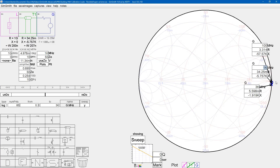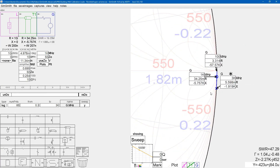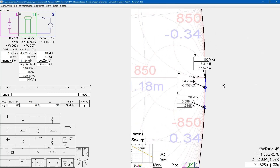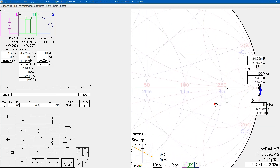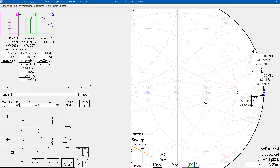Here's an example in SimSmith as to what's going on, which might help. I've got an open, as referenced by a one-gigaohm resistor, and a small piece of transmission line which matches my measurements — 11.34 milli-inches. I ground off 12 milli-inches; 11.34 is what SimSmith predicts. It's really hard at those numbers to see whether the dot has a little arc. But if we look at 100 megahertz, we see no rotation at all. At a gigahertz we see a rotation, and at three gigahertz we see more rotation — this is due to the extra piece of transmission line.